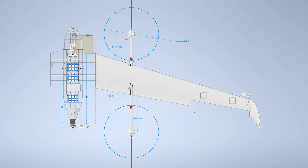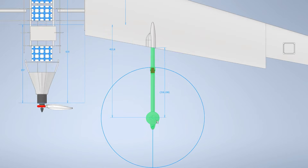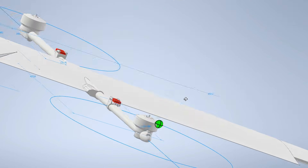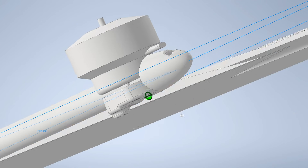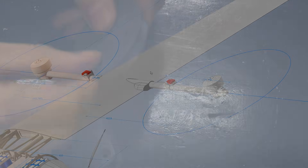I positioned the motor arms relative to the fuselage so that they don't shift the theoretical center of gravity of the model. The CG should be located at one-quarter of the wing's mean aerodynamic chord from its leading edge.